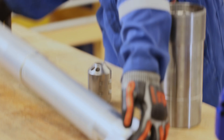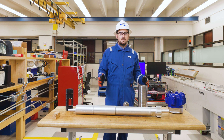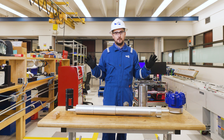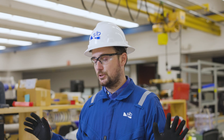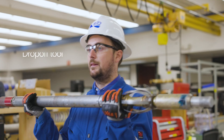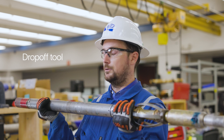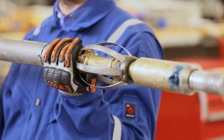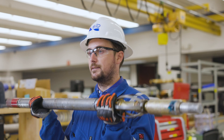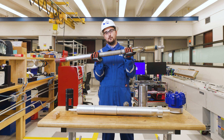Now we've deployed our tool string inside our BHA. The next critical part of the operation is dropping off the tool string, or releasing the tool from the wireline. This is make or break it for a ThruBit job, and that's where we have our ThruBit drop-off tool. In the last ten years we ruggedized and fortified this tool, improving the motor, improving the shock dampening, and allowing us to now deploy in heavy mud environments. The success of the job comes after we disconnect here and pull the wireline out of hole.